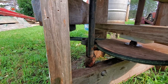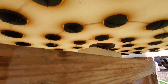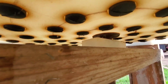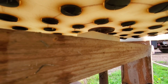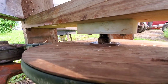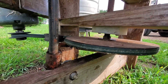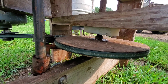The tensioner pulley sits on a piece of half-inch black pipe. The axle is a floor flange with half-inch pipe screwed to the UHMW. The bearing is a white UHMW piece that goes through — same thing down here. It ain't gonna wear out for as much as this thing gets used, but it sure beats plucking by hand. I could change the gear ratio too.